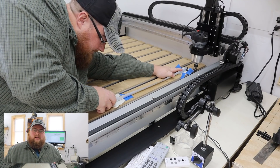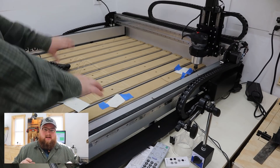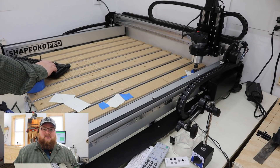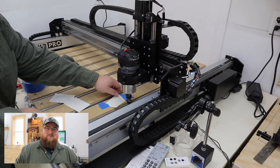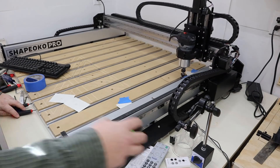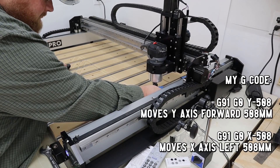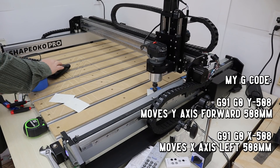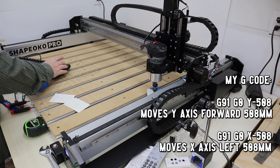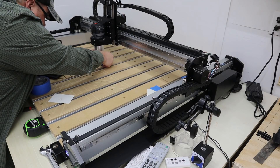My methodology for checking the calibration of my motors is one that I saw from another person's video on YouTube — there is a link below to this video. It is very detailed and was very helpful for me in doing this procedure, so I'm not taking the credit. To summarize the procedure for calibrating and checking your motor steps to reality: you use custom G-code commands to move the machine a set distance, then verify that distance with a tape measure or other measuring device. I chose to move 508 millimeters, which is the same as 20 inches, for my Y and X axis verifications.